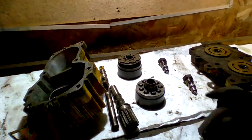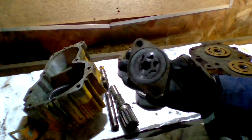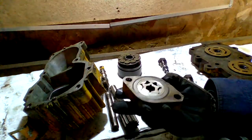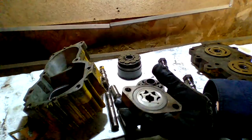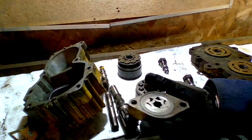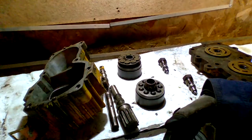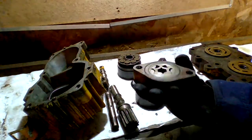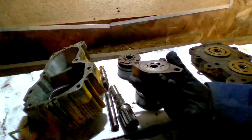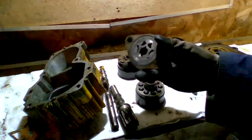From there, it goes to the charge pump. And this is the charge pump. It's a six-tooth gear, and the outer gear is seven. And that creates that gap. And that pumps the oil up to the main drive assembly, because this design with these piston blocks it cannot pull fluid up for itself.